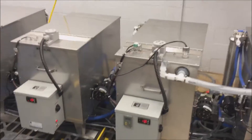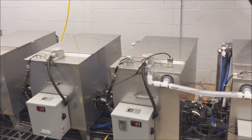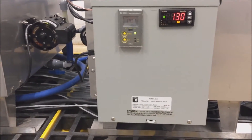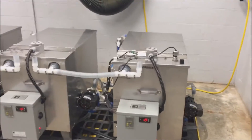The first rinse tank, in the middle, is used after the wash cycle and each of the citric passivation cycles. The two second rinse tanks are for the magnetic versus non-magnetic stainless steels and allow for a pure final rinse by monitoring conductivity, temperature, and allowing for a constant inflow of fresh DI water.